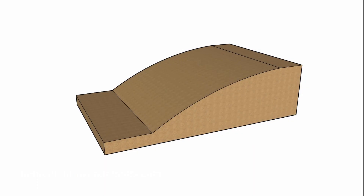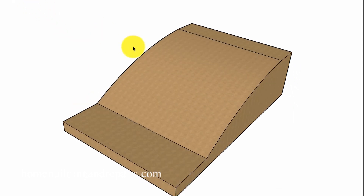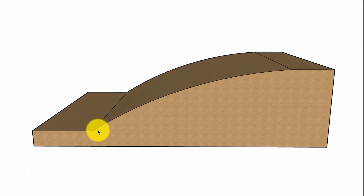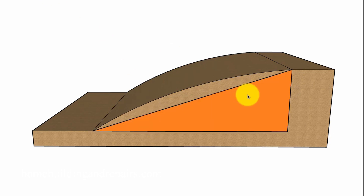In this video, I'm going to provide you with another idea. I'll put a link at the end of the video with another method for figuring the height for a stairway — one where you're using a bunch of stakes, a water level, to figure different heights until you get to the top. But in this one, I think we can do it with a string and a couple of stakes, and it should work for any type of hill. The reason I'm making this video is because someone said they had a really steep hill that was rocky and they couldn't drive any stakes into the ground.